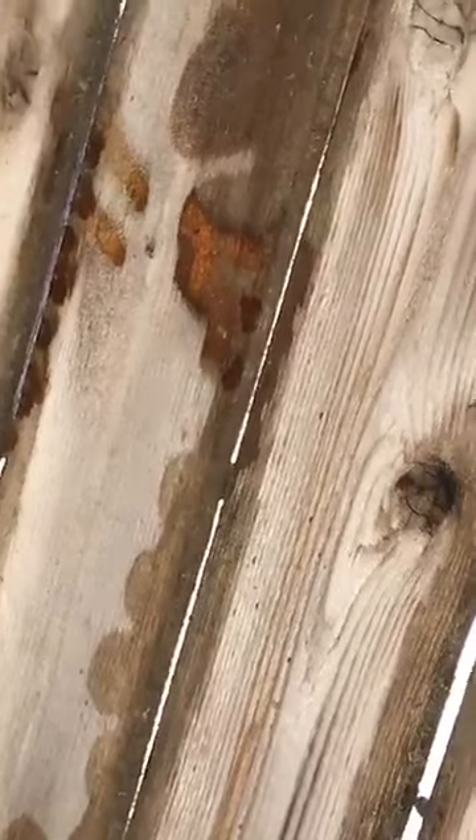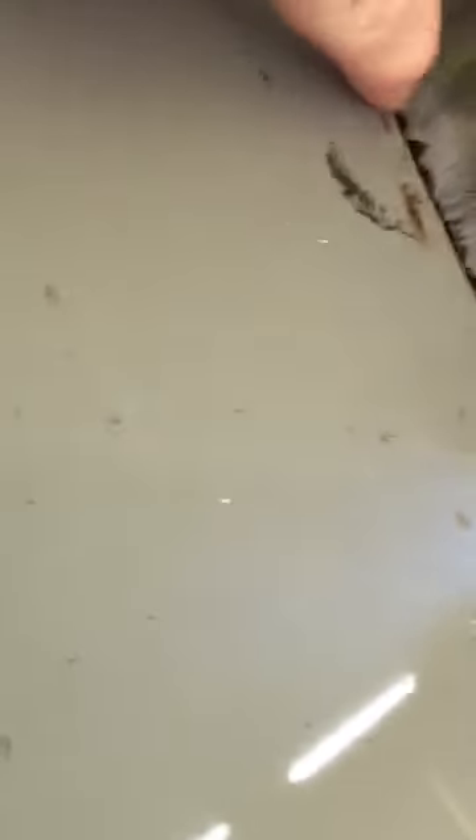We're going to go over here and this 5-quarter decking — you can see from down below here — it's showing signs of chronic moisture starting to seep into it. It's kind of green down below, which is early signs of rot. But then there are a few places where I just happened to step in the right place and found a deck board that was totally rotten. I believe it was the end of this one right here. You can see there's an edge there. If I stick my finger up in it, I can stick my finger into the wood — that deck board is totally rotten.